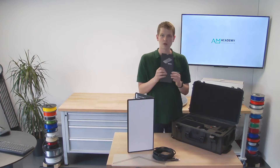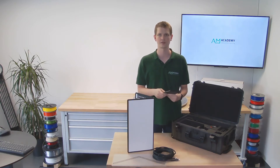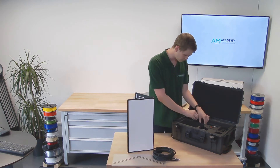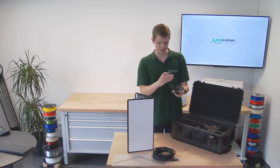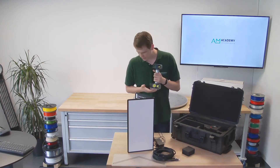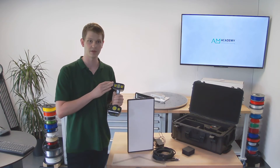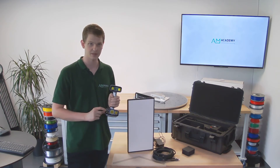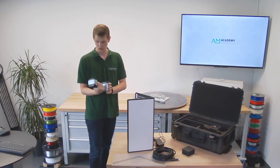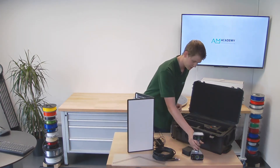There is a packet of markers. For the laser light mode especially, you do need to use these — stick them all over the object that you are trying to scan so the scanner can pick it up. There's a variety of power plugs depending on your country's outlet, and a power brick. And then, most important, the scanner itself. The upper part is where the visible LED light comes from, there's a color camera to pick up textures, and it also has the blue light laser.